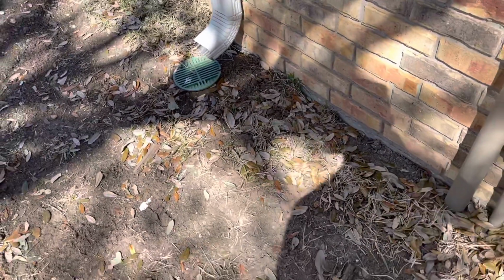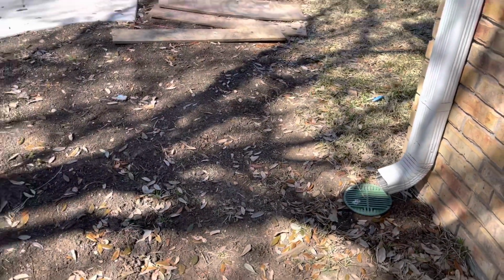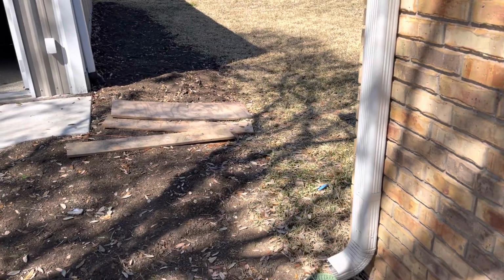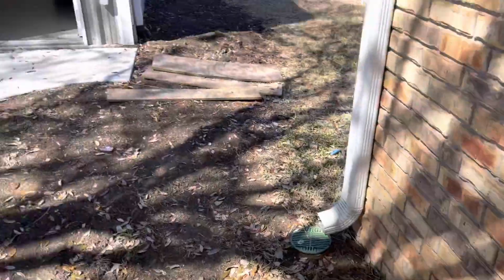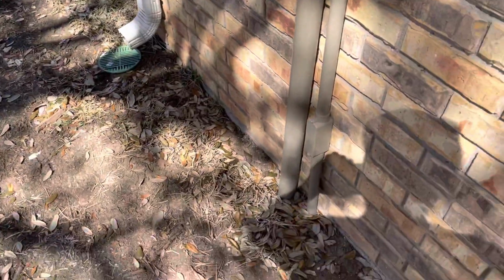This 2-inch pipe 90s 2 feet down. The inspector said got to have 24 inches deep. So 24 inches deep, there's a 90 with an insulating bushing on it, and then it's just bare wires. There's 4 of them down there. I read somewhere that underground wires might be a little bit cooler, being in no pipe, because there's nothing to restrict them and the ground will keep them cool. But I just didn't want to wrestle the wires in a pipe underground all the way from the middle of the attic, all the way down here, all the way to the shop and up into the sub panel. I didn't want to do that. So I only had to wrestle them down to here.